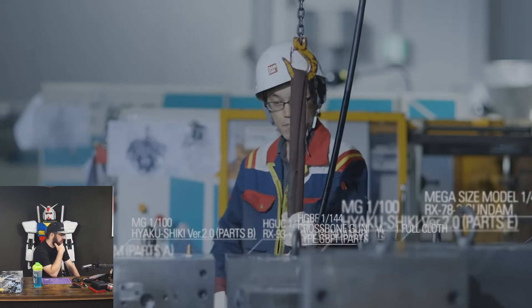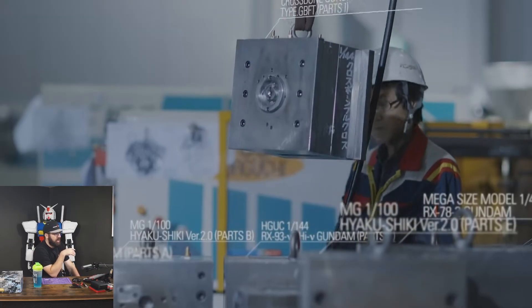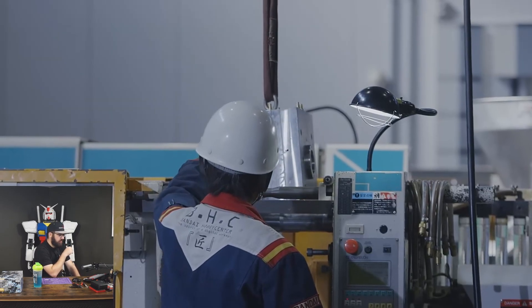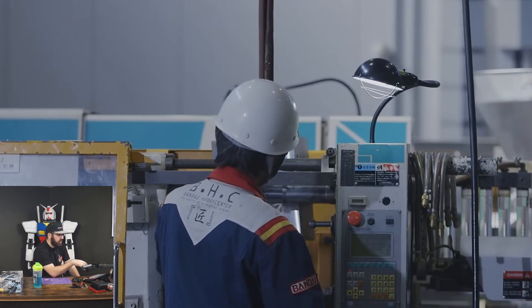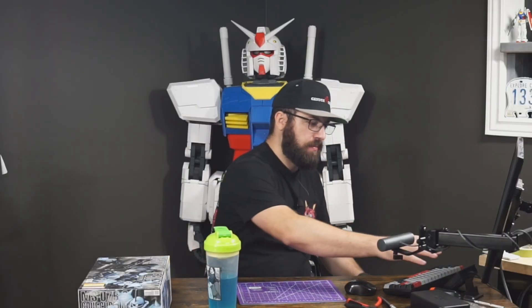These are all the different parts, kits, and different molds. These are small molds — a couple hundred pounds, P20 tool steel. They look like they're single-drop molds as well, so they probably don't have a hot runner system. And yeah, they don't. You can see the little spigots there — that's for the cooling. You hook water up to it and run water through the mold to keep it at a consistent temperature, because once you start running plastic through it, certain areas start to heat up.